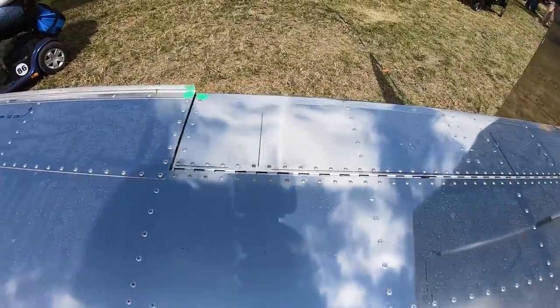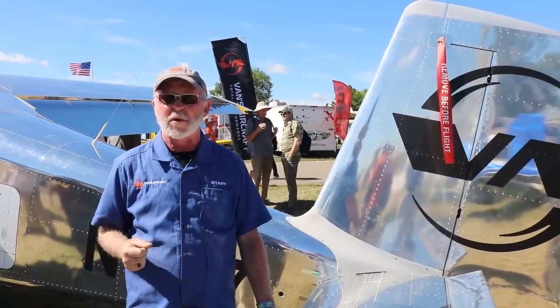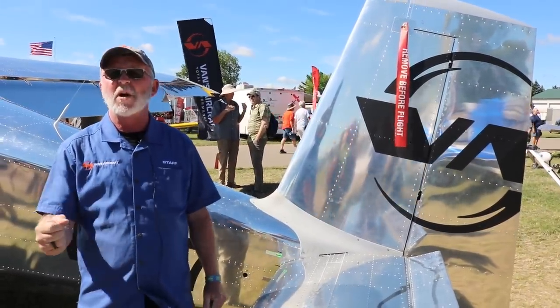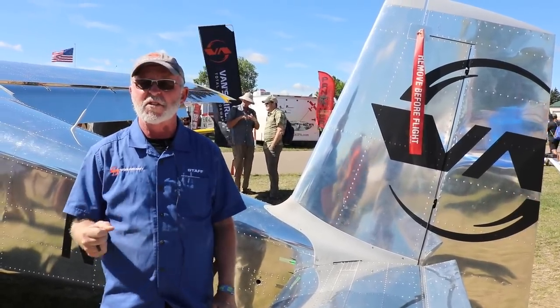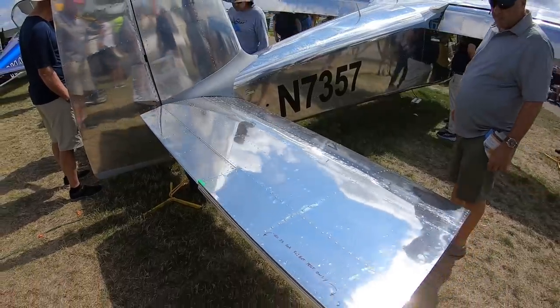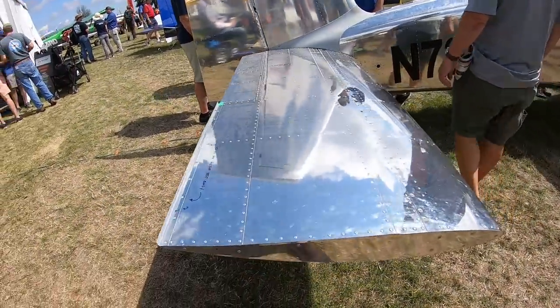When you're at a high alpha, the stabilator gives you a lot of variability in terms of maintaining authority, because the big surface area is all in control, and gives you more options and better envelope expansion from a maintaining authority perspective when it gets to going really, really slow and getting the nose super high. So you're thinking is forget the typical horizontal stab and elevator and putting VGs on it. We'll just move the whole entire surface.